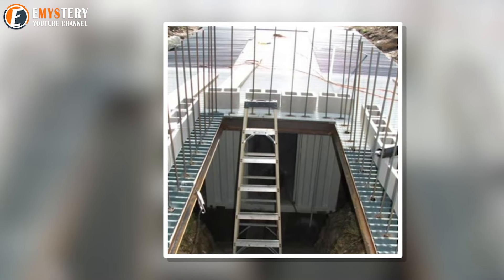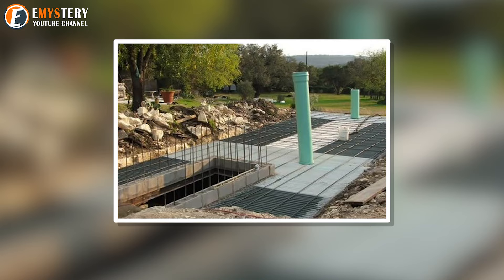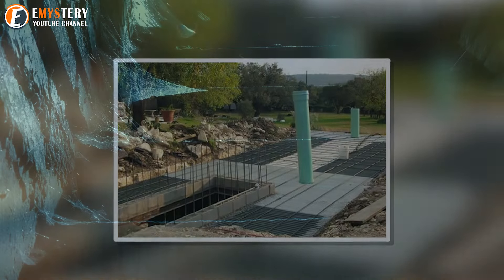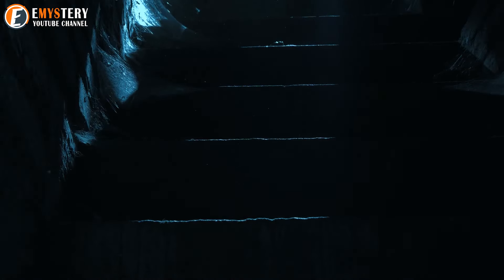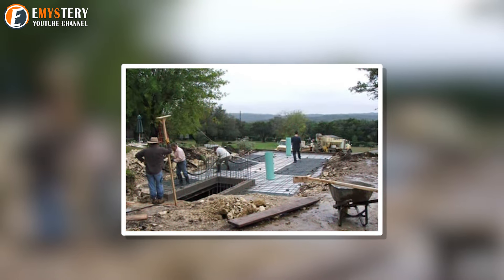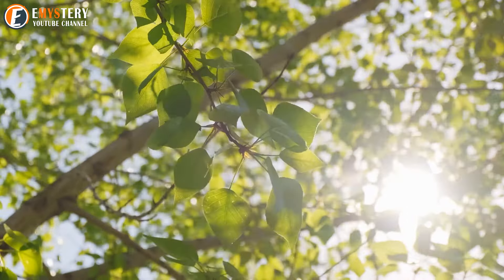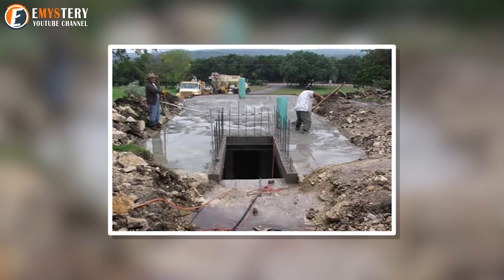Now that the exterior was taking shape, we still need to know what's going on with the inside of the bunker. Evan wasn't satisfied with just a regular entrance — once he had the roof set up and secure, he created a grand entrance, leaving an opening in the roof and setting up rebar for support. Evan took safety very seriously, ensuring everything was up to code. The most important addition was the air vents — he installed two 12-inch air vents at the front and back of the bunker, since you wouldn't last long underground without access to fresh air.